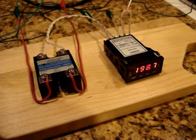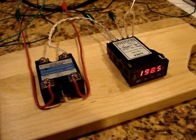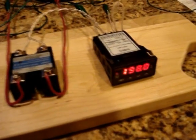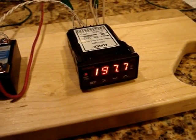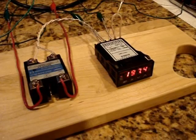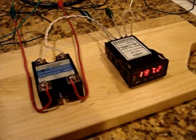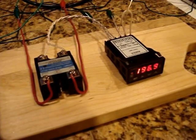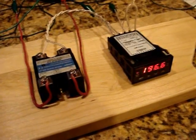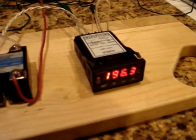So it appears that it's hunting around to see, based on the input of turning the heater on, what kind of response it gets as far as bumping up the temperature. Now you can see the temperature is falling again. It's just injected a brief amount of heating, and it seems to be digesting what the effects of that jolt of heating are on the temperature curve, I guess.